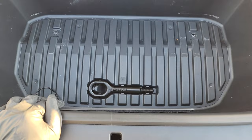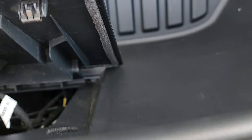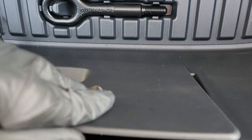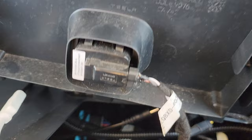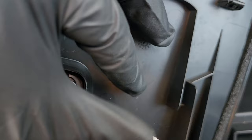You also need to pop out this piece right here — pull it straight out and pop it out on each side. There's a clip there, a clip there, and a clip in the middle. Once you pop those straight out, pull straight up to unhook it from the bottom, then disconnect the trunk/frunk release switch by pulling the connector straight out to the right.